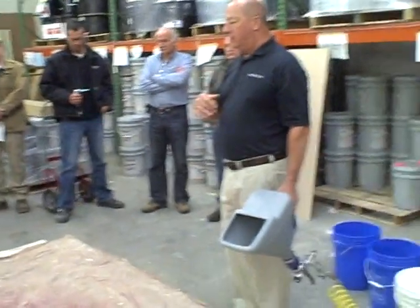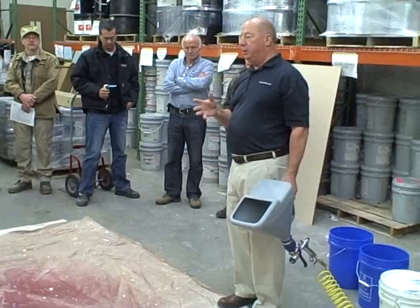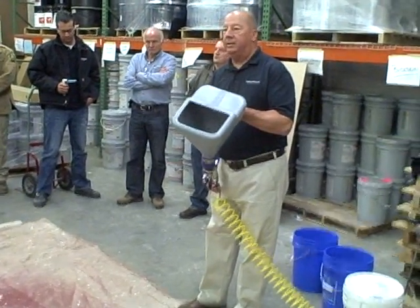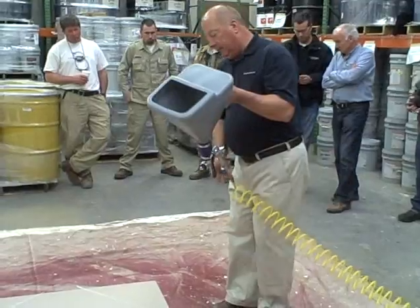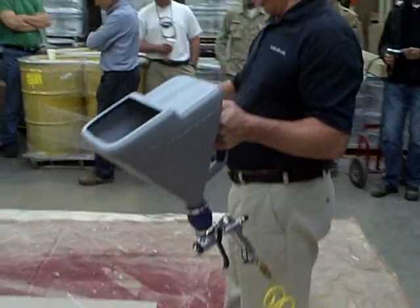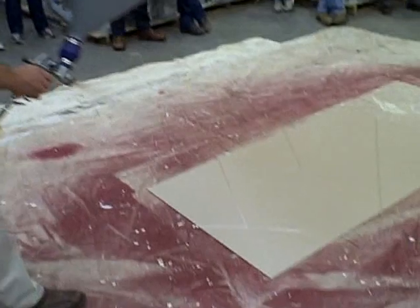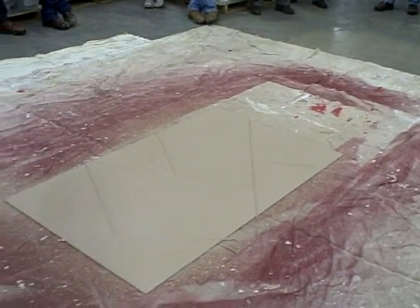This could be any color combination you want. For example, if you wanted a gray color for your brick mortar joint or grout line, you could do that. I'm going to shoot this now through a hopper gun. By adjusting your air, you can get different textures. So you'll see how fast and easy it is to spray. I'm going to go with this much air and cover it about 85%. Now I'm going to lower the air pressure a little bit and get a bigger splatter.